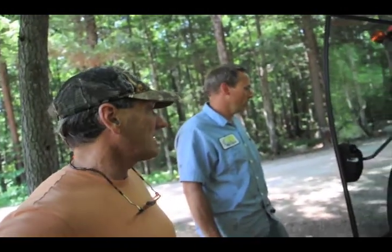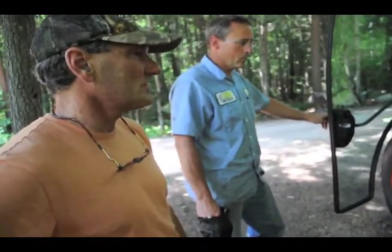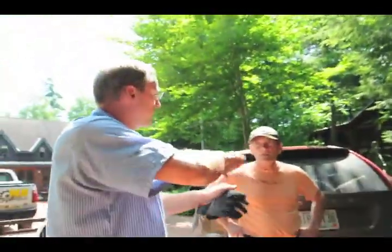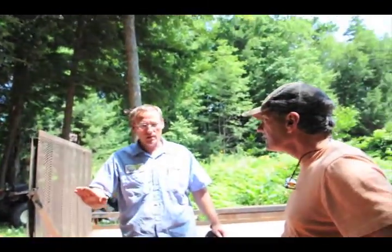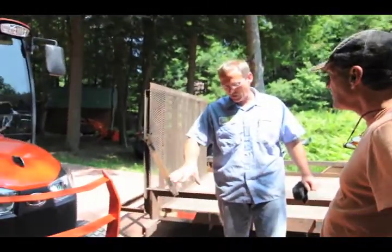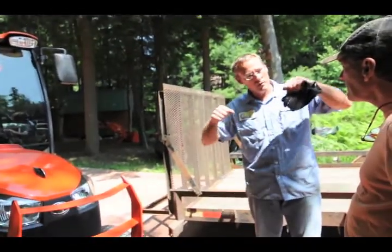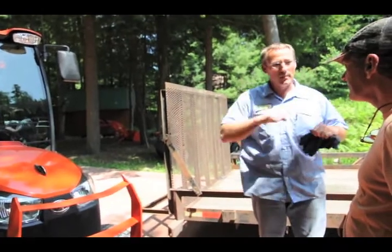It may take like, I've rented them, and once I get into them it takes me 30 minutes to an hour. They creep until they get worn in on the pedals because the tolerances are so tight. They will creep. They're spring loaded to come to the back, and you'll notice when you're going easy and you let off, it'll kind of keep creeping. So you want to be ready to center it. But if you're going really fast and let off, because the spring is stretched out more, it'll snap back to neutral. Okay.